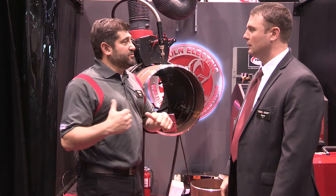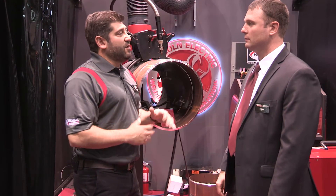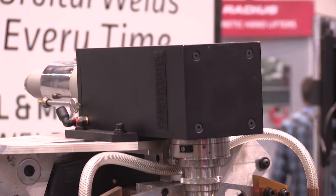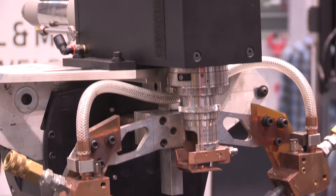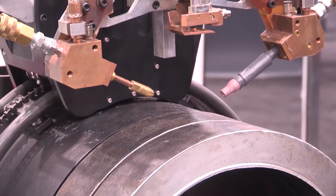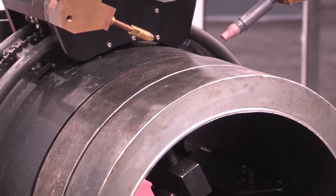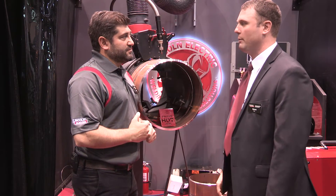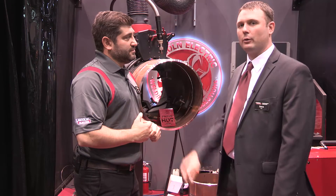We're going to step over to another piece of equipment. It is a hot wire laser, and it's an adaptation of this exact same platform, same weld head. What we've been able to do is, leveraging all of this digital technology, we've actually bolted a laser onto it, and we're able to do a hot wire laser with it. It's an incredible deposition increase and quality improvement to standard welding that you would normally do with orbital equipment.